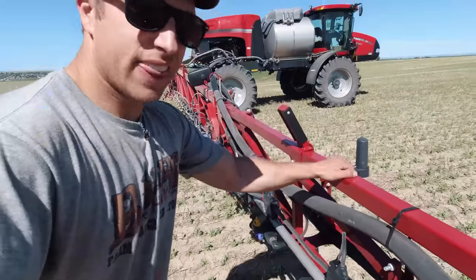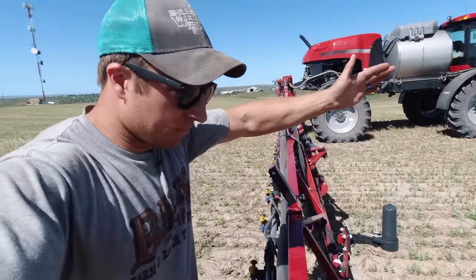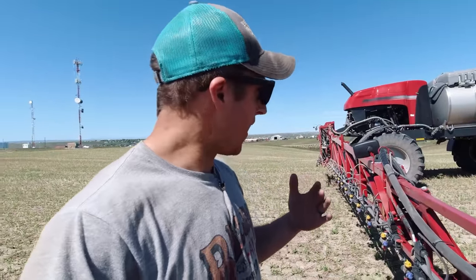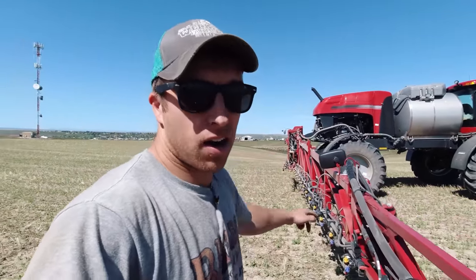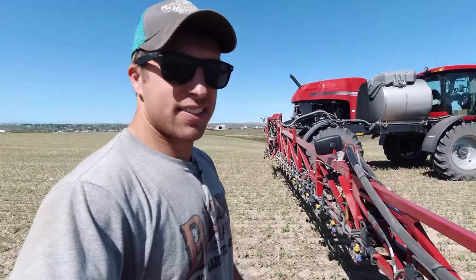Another thing I noticed, I think I've like a couple times been like, why is it swung forward? It's like kind of facing inward. It needs to be out and straight. Well, I noticed when you slow down to stop, it actually lets the cylinders collapse a little bit to relieve the tension on this boom. Because there's a lot of binding that takes place up here. If the whole boom tries to stay rigid when you stop, it's gonna wanna pull that boom forward. It lets it do it.